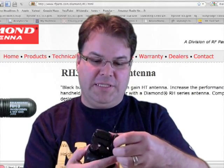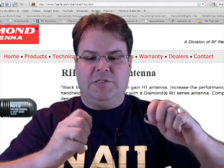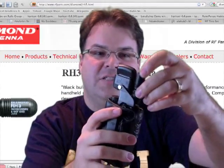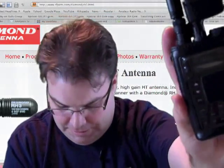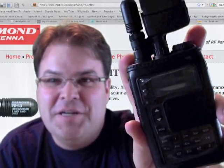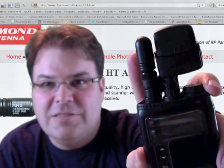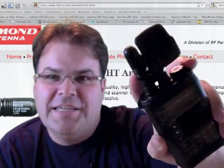I bought a little adapter device — here's the antenna itself, BNC — and then I bought this little tiny SMA adapter so the BNC can go on like that. It still allows you to screw the antenna all the way down on the radio. What's cool about this adapter is it spreads the weight of the antenna across the whole base of the radio. I think this is a good idea even if you have a taller antenna. This little Diamond RH3 tri-band is quite amazing.